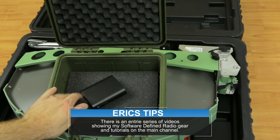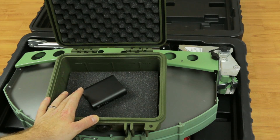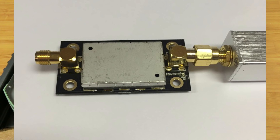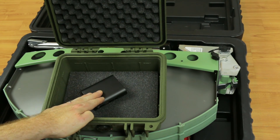It's going to be coming down at around 1500 megahertz, and we're going to pipe it through a 34 dB gain LNA, or low noise amplifier, and from there it'll go out to the SDR and into the Raspberry Pi.